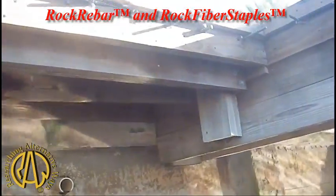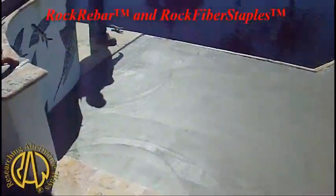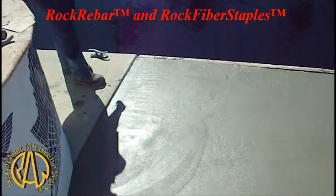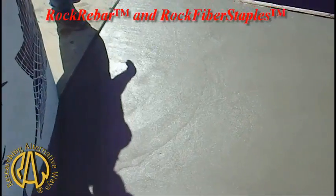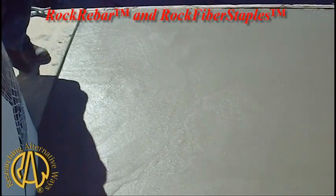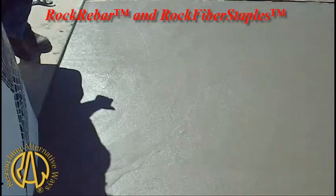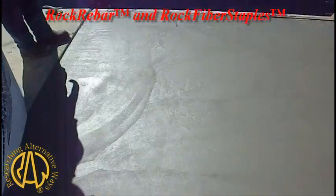Video of the underside of this — this is the old dock, and they'll always put the forms on it. I'm down here to see how much it's sagging because they're putting 43,000 pounds of concrete on top of it. What do you notice about those fibers? They stay down better than the other ones. They're heavier, and we put an agent on it to keep them from sticking together and make them disperse out into the mix better. If it's working, you're the judge. You can't really notice them when you're troweling the surface. Usually with the other ones they'd be coming up on the surface — you'd see them. You don't really see them right now.